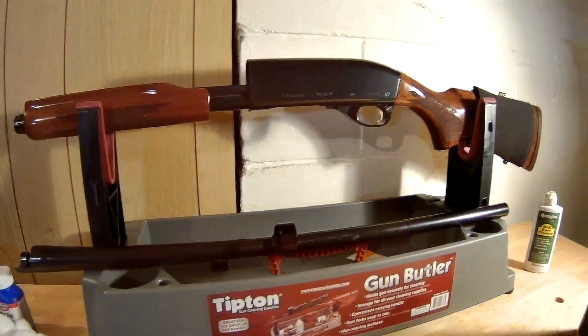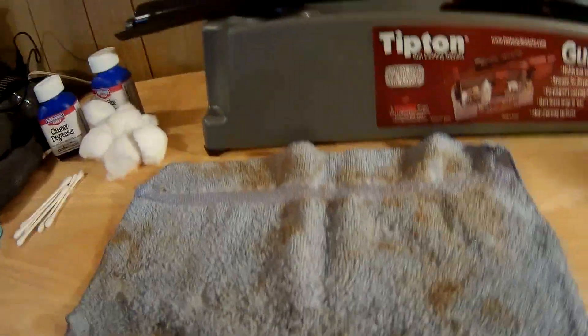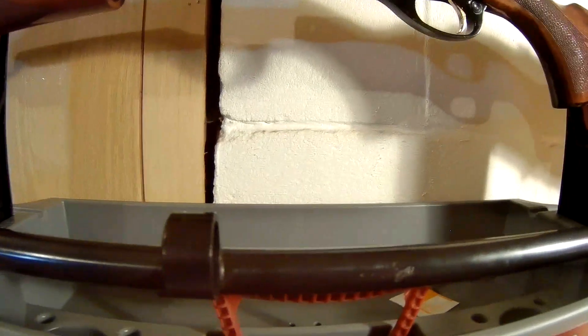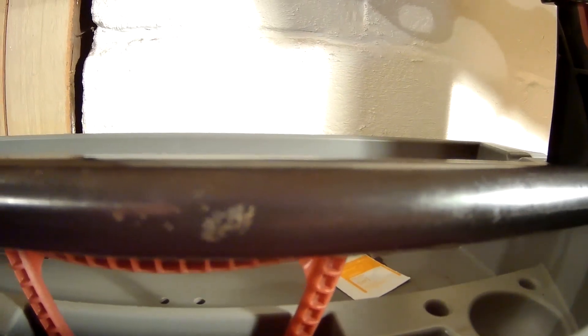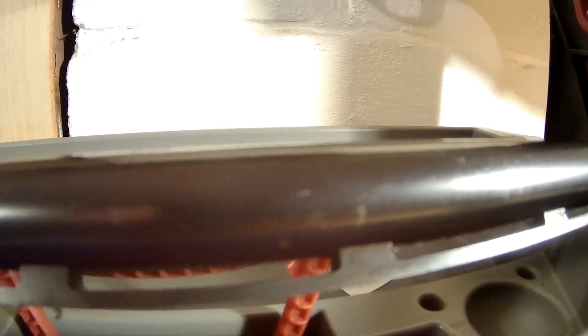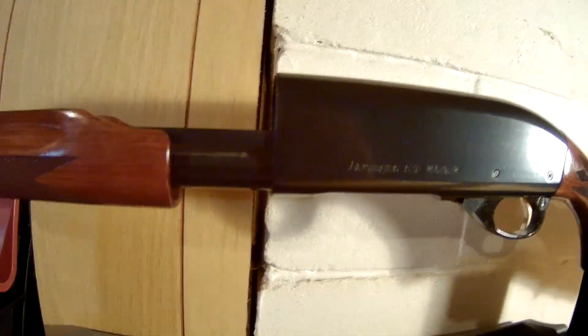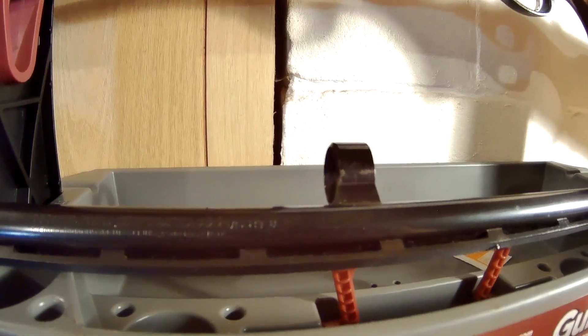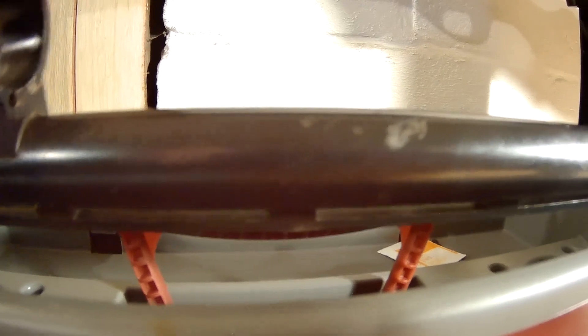We went through the scrubbing process and got all the rust off. I was surprised how much rust it took off — you can see on the rag. There was a lot of rust you really couldn't see with the naked eye, but as I started scrubbing it revealed itself. There's a pretty hefty spot where the blue on this gun is damaged, which is probably why I was getting the rust. You can see the spots where the finish got damaged from the water. I also did the main part of the shotgun and cleaned up some spots there too. The factory blue that wasn't damaged from the rust is intact — it's not scratched. It looks really good and I think this is going to work.